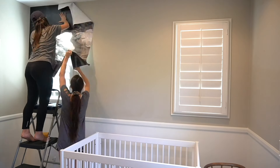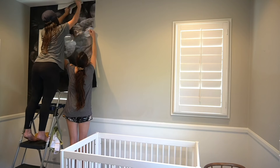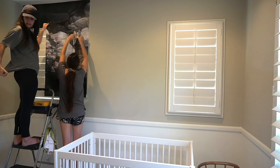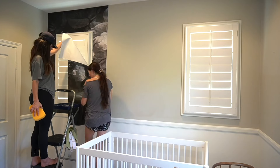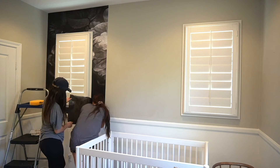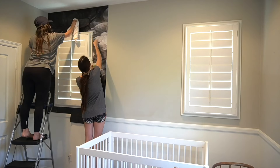For the second piece of wallpaper, start by lining up where the mural or repeating pattern continues. Place the wallpaper so the pattern continues and press the seams up against each other. If there's any gap you can just push the wallpaper over — I was impressed by that. I thought we'd have to peel it off and replace it, but you can just place it on the wall and use your hands to push it over so the gap closes and the seams align perfectly, hiding any visible seam. Once the seams are aligned, the top edge should also have two to three inches off the top. Trim off that top excess first, then continue working down and cut in along the window, going slow and making intentional cuts so you don't accidentally cut too close or too far.